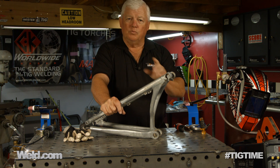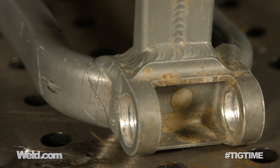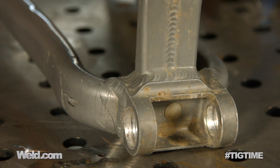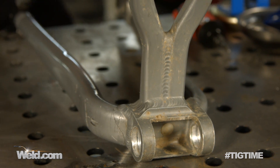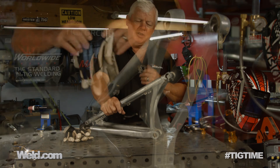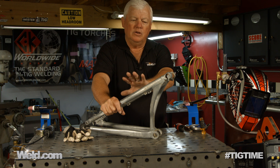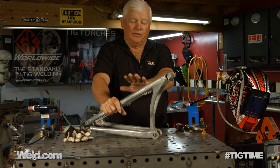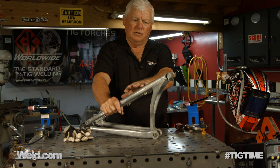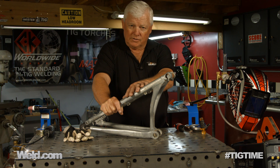Here's the choice, and we've gone through this selection process many, many times. The cracks are pretty significant — they're in the welds and have migrated into the parent material. So we have to know that we're only going to use maybe 50 to 75 amps on this. Now, let's pick the filler selection because that's always an issue. This is an unknown alloy, but we know that it's weldable, and very highly likely that it's a 6000 series.